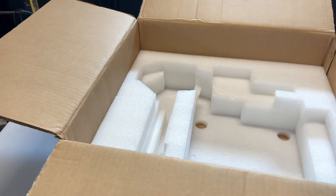This is a manual bed level system. You can follow the prompts on the screen and use the paper test method. Go ahead and adjust the knobs like you normally would and you're ready to print. One of the nice features is that you can use a micro SD or a USB card reader — I am going to use the USB card reader route.